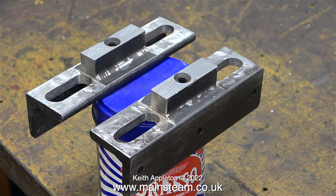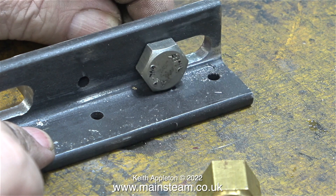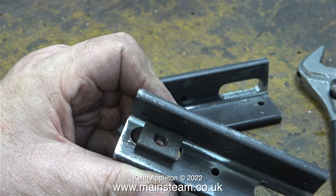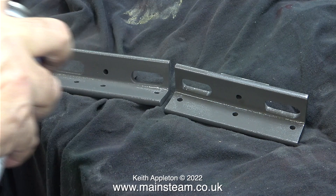At this stage I was thinking of some really complicated ways of making parts to slide up and down the slots, and most of the ideas I had involved the use of hexagon bar. I also considered: why not use something that's already made, like an M10 bolt? But the boiler mounting does have to be slightly more complicated than this — if you watch the next episode you'll see what I do. I toyed with the idea of making some T-nuts, and here using a commercial T-nut you can see what I'm thinking. But owing to it being Christmas Eve and not having any bar stock of the right size and unable to get any, I abandoned that idea.